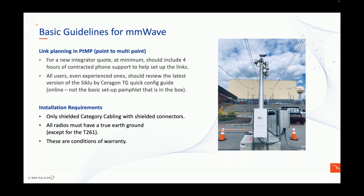The other thing I want to recommend is that you start looking at cable certifiers rather than just standard cable continuity testers. The reason for that is when you start getting into throughputs above 1 gig, and all of our Terragraph units, except for our 2 small guys, all run multi-gig RJ45s. You're going to notice, not just in our devices, but other devices, that you can actually show a connection with a continuity tester, but it won't pass the signaling that you need with a multi-gig port. Okay, keep that in mind.